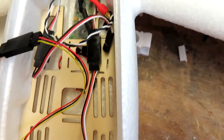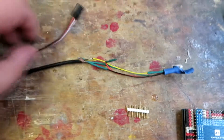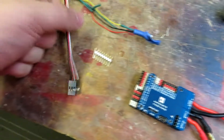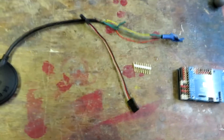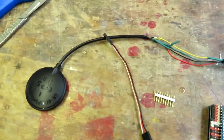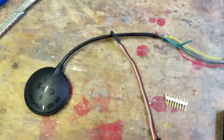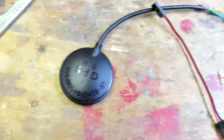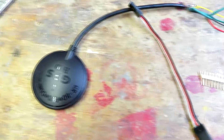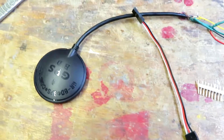What I'm about to do is re-solder the connector on here. Since I'm not using the old board anymore, I need to take the connector off and put on two leads: one for power and negative, and one for receive and transmit for the GPS. You don't want to get the power leads the wrong way around, but if you get the transmit and receive backwards it doesn't matter - it just won't work and you flip it around. It'll be a bit harder to fit than the other board, but at least this board works.